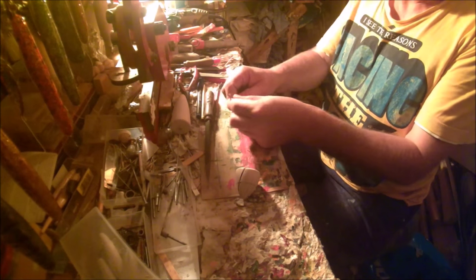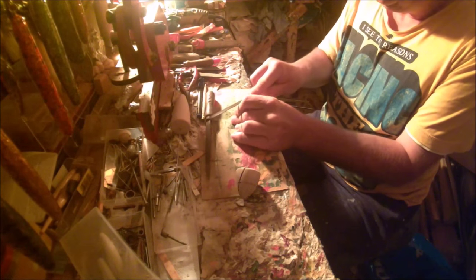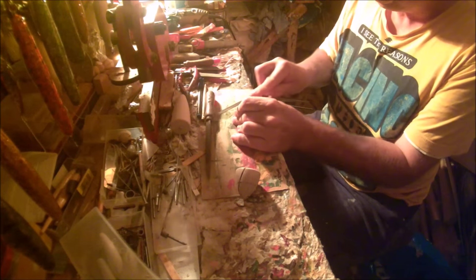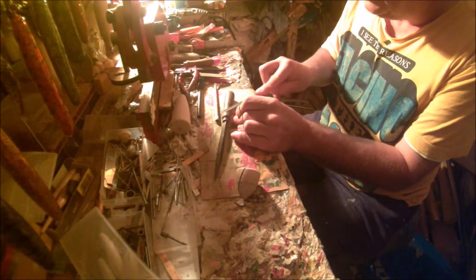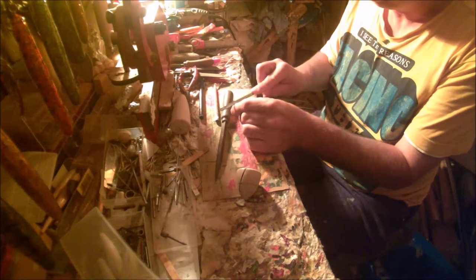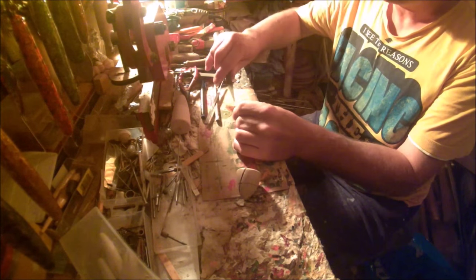Now I've cut off the length of my brass tubing, 3 by 2 mm. If cutting off in a vise, just make sure you wouldn't squeeze the tubing too flat, so do not clamp the vise too tight. Now I'm just filing the ends plain, breaking the edges. This one is going to be inserted into the head to act as a bearing bushing. Also break the inner edges.